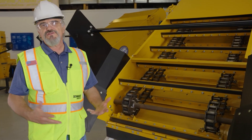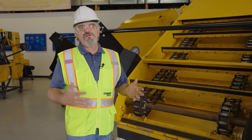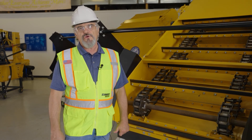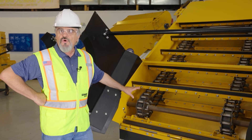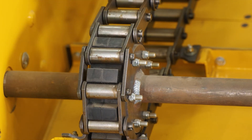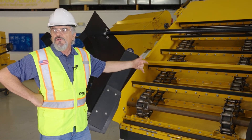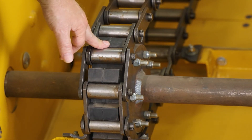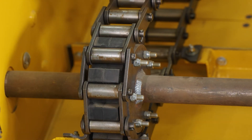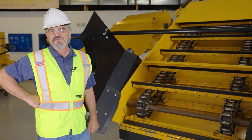These are the adjustments and checks that need to be performed on the conveyor chain to confirm the sweeper is working properly and efficiently. During inspections, check the sprockets — there is one at the bottom and two on top. Millings, being the most notorious material picked up, tend to stick between the sprockets and chain, causing premature wear. Once sprockets start missing parts, they must be replaced.